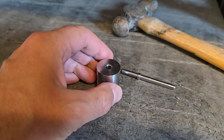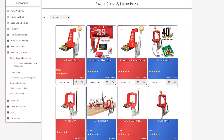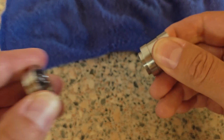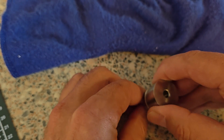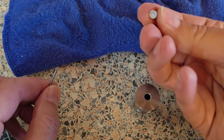After making a few slugs, it's easy to figure out when the slug is properly formed. If you have a press capable of a few tons, you can use that instead of the hammer. When the slug is formed, the base is removed, an ejector pin is inserted, and the final slug is pushed out. Depending on the precision of your die, base, and piston, there may be some flashing.